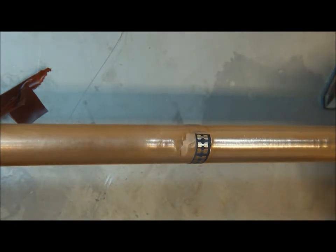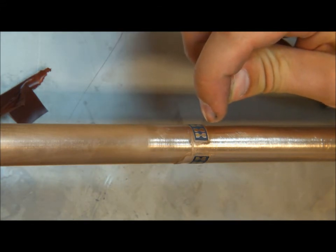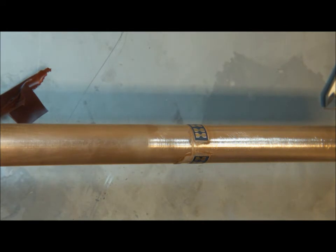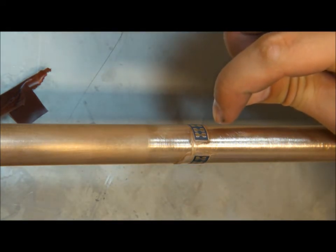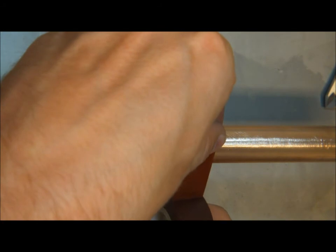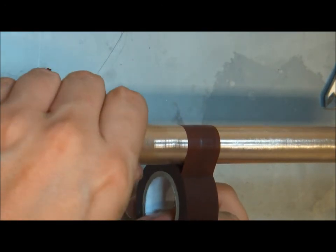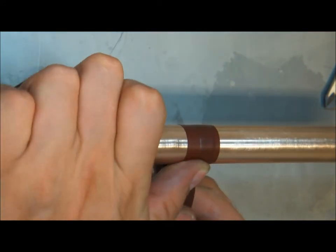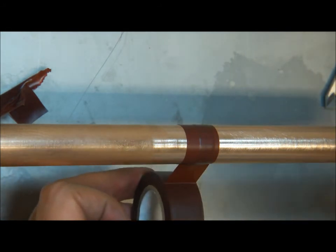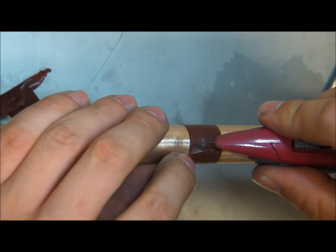You can see here I didn't manage to align the soldering pads carefully, and there will be some distance between the end of the soldering pads and the beginning of the strain gauges, and we must prevent the strain gauge lead wires from coming in contact with the Hopkinson bar. So what we can do is to attach a layer of tape to our soldering pads.